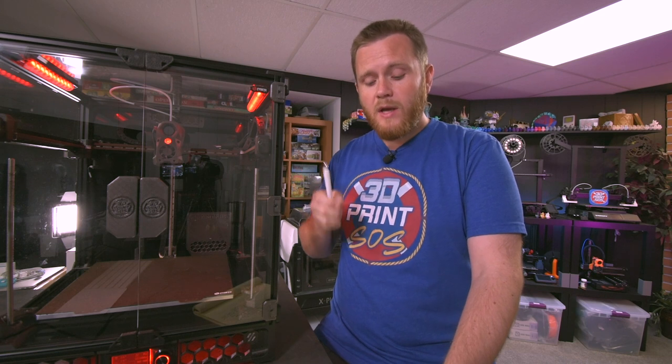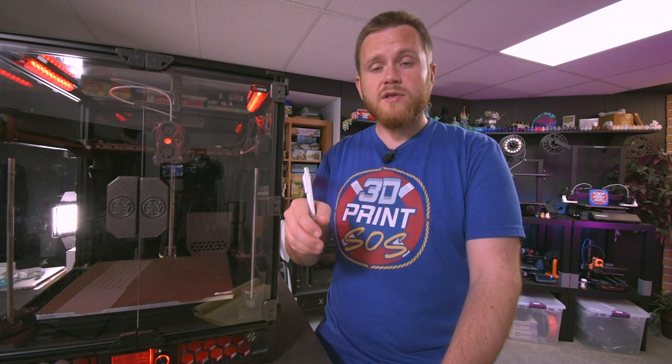Obviously, if you've never set that up before, it is definitely at least difficult looking. From what I understand and what I've been told, I haven't done it yet on this, I'm going to do it when I do the tool head, it's just some copy and paste, and then making sure you have a couple settings correct for your particular machine. I know why they included these things, because it is unsafe to copy someone else's sensorless homing settings, because every single machine is going to be slightly different on the highs and lows of where the stepper driver and stepper motor need to be.